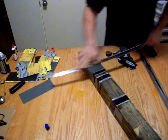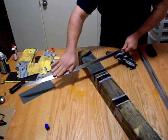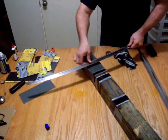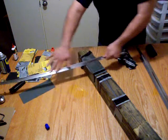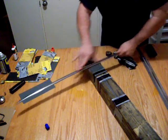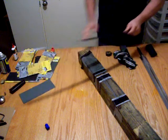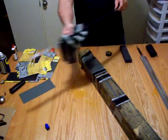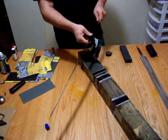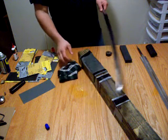Try to only scratch in one direction. Don't work back and forth on your paper because it's hard to control — one direction sharpens while the other dulls your edge. So go the same direction every time. As you polish and go through the grits, your sword is going to get sharper and sharper until it's really, really scary razor sharp.